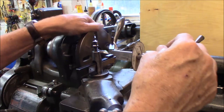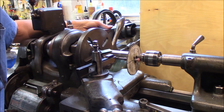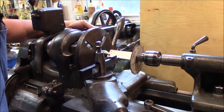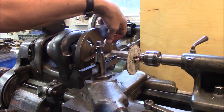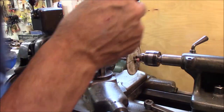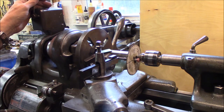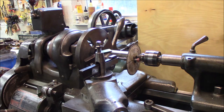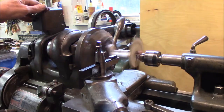Make sure your faceplate's tight, make sure nothing's hitting, no interference. I'm just going to turn this on and run it for a second for a demo, because I'm really not set up — I'm not going to cut anything. I'll show you how it flops around. You can put counterweights — some big washers — bolt some washers opposite to smooth it out if it's flopping around too much. I ought to plug it in first — that'll help. Stand clear. You can see it flopping around.